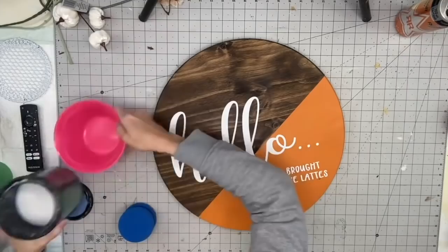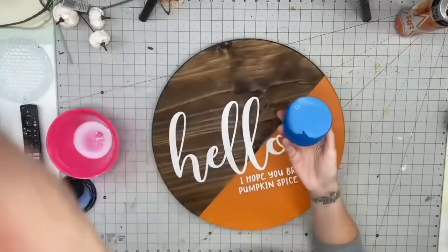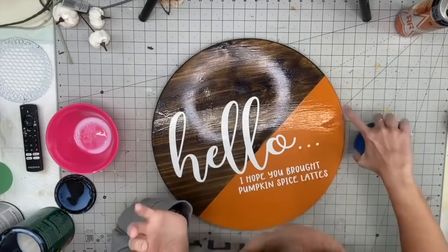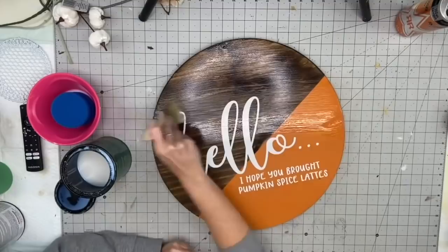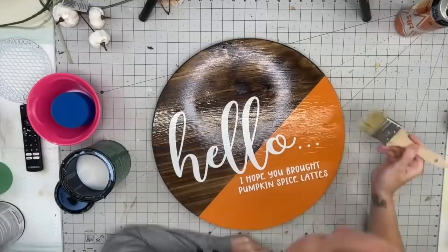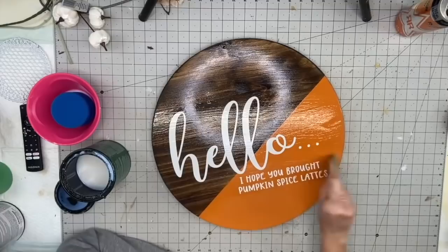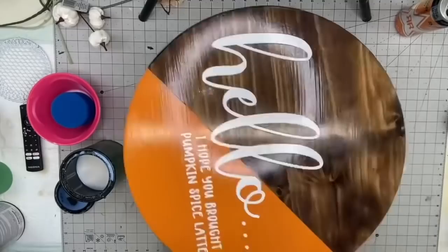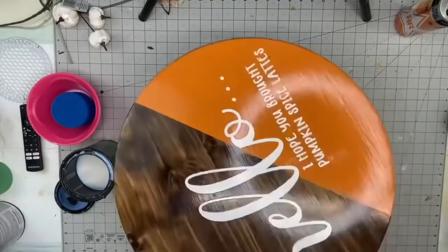After we're all done, I tried a different furniture applicator for clearing it, but I don't know if it's because Helmsman is thicker than polyacrylic — it was tacky and felt gummy. So I went back to my tried and true chippy brush. I'm applying the water-based Helmsman — water-based, okay — because if you use oil-based it is going to turn all of that white yellow. The sign is going outside so you need to protect it from the elements; polyacrylic is not going to do that — it's for indoor use.